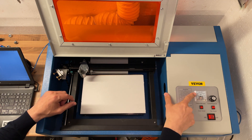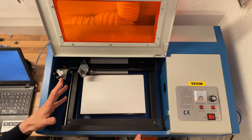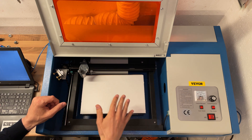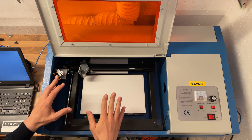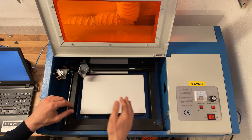I'm using 2.5 milliamps. In K40 Whisperer, I'm setting the speed to 30 millimeters per second. Then I do four passes to get a full cut. Already on the third pass some of the parts are cut 100%, but on the fourth pass everything's cut.